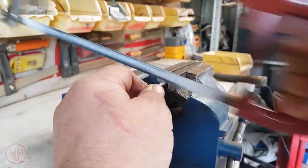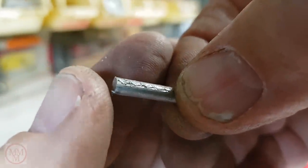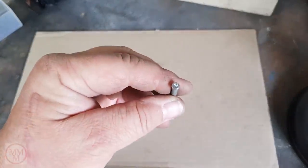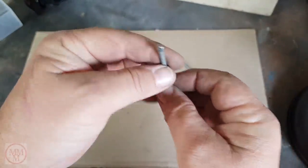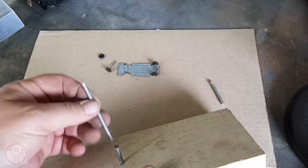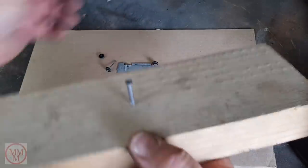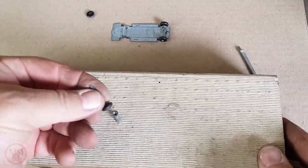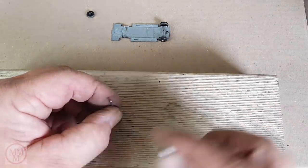So now I'm shortening it so it will fit in the chuck easier. You've got to be careful — there's a bit of a burr on the end. Whenever you cut metal, that's quite common, so you have to get rid of that with the file so you don't cut yourself when handling it. So there's the tool — but not only that, I've made a second one, only this one is the full-length nail. This is going to be the support nail. What you do is get a scrap piece of wood and hammer it in so it's perfectly vertical. That will support the axle whilst the actual forming tool comes down on the other end of the axle, so it will be sandwiched between these two nails.